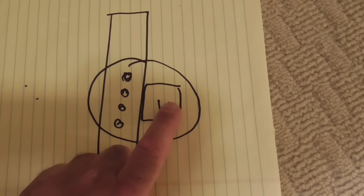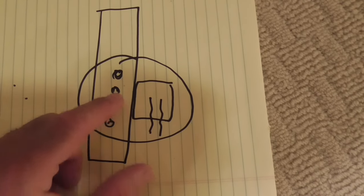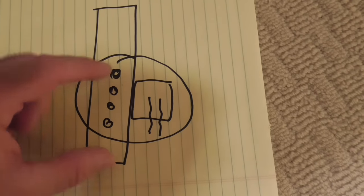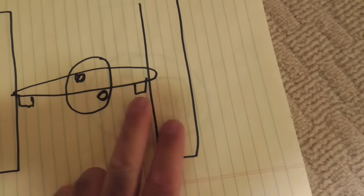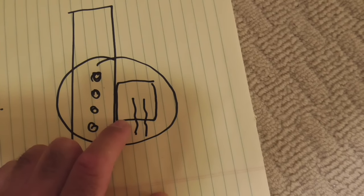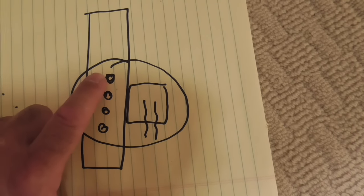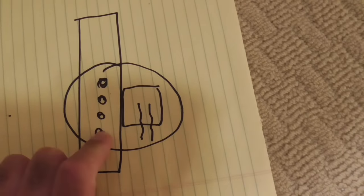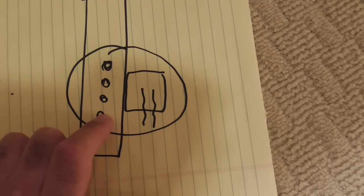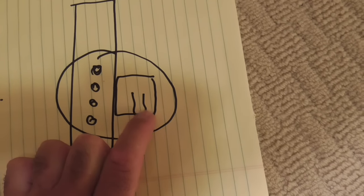But what they did then is there's a big bracket, a big plate. And what he did is he took this plate and centered it over the stud and drilled the plate into the stud. So rather than having to put this whole thing in there and try to level everything out, all he did is he took the plate, which is underneath that cone-shaped piece, that shiny piece I'll show you again in a minute. He took the plate and placed it on the ceiling, drilled four holes. This plate is more in the center, but it really doesn't matter. It was secure into the studs with 3-inch screws. It is going absolutely nowhere ever. He used an impact drill to drive the screws in there 3 inches, so you've got 3 long screws holding all the weight. Nothing was being weighted down on the junction box.